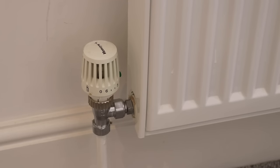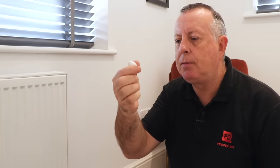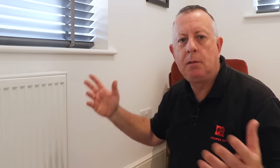To do that I need to shut the valves at each end of the radiator. One is a thermostatic valve, which is straightforward. The other end has what's called a lock valve, capped off with a dome-shaped plastic cap. I'm going to have to use an adjustable spanner. But before you go closing all your lock valves — if your central heating system has been balanced so it all heats up evenly — when you close these, count the number of revolutions it takes to close, so when you open it again you can put it back to exactly that position. I'm going to put a post-it note on here so I can do that in a couple of hours.